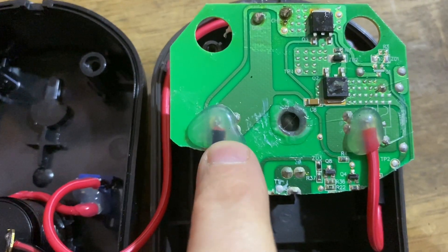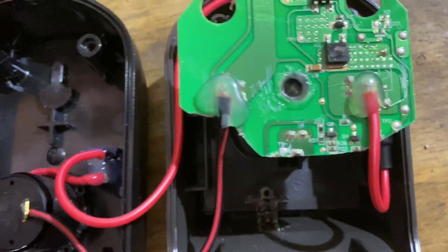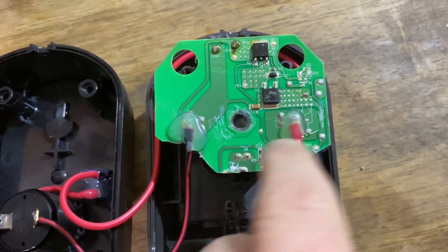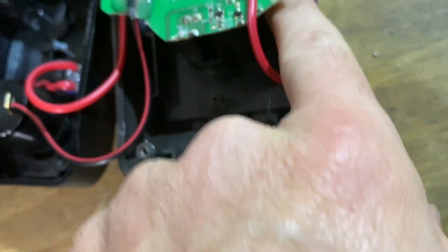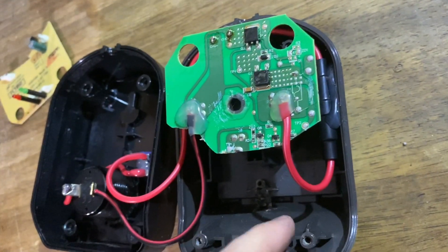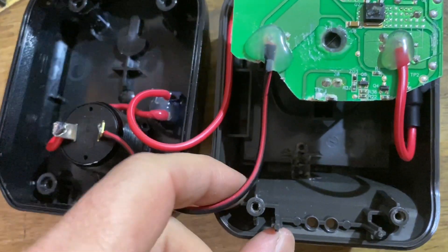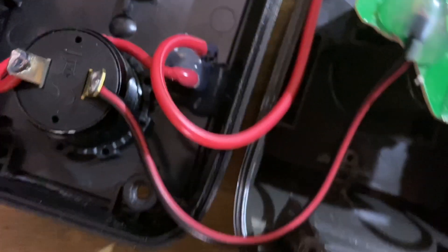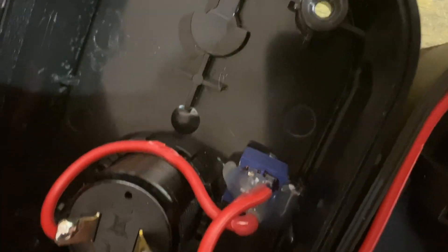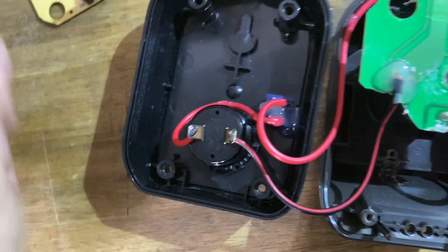Before you smear hot glue all over it, it's real easy to read: battery negative, battery positive. And it's also real easy to see it corresponds to the tang. So what I did was I cut the board off, then I put a battery in it carefully to make sure there were no shorts — and there weren't, because the leads are all just sliced off and nothing crossed over. Soldered my leads on. My particular USB charger came from Amazon with a fuse holder; I went ahead and retained that even though the batteries have some built-in protection. So I left that fuse in there. The hot glue is just so it's a little bit more durable. Took the negative straight to the negative on the USB charger, took the positive, left it through the fuse, soldered it up to a switch which I bolted in place with some more hot glue behind it — I like hot glue because it keeps things from vibrating around and you don't have to take them apart a year later. Then soldered it up to that. So that's literally it.